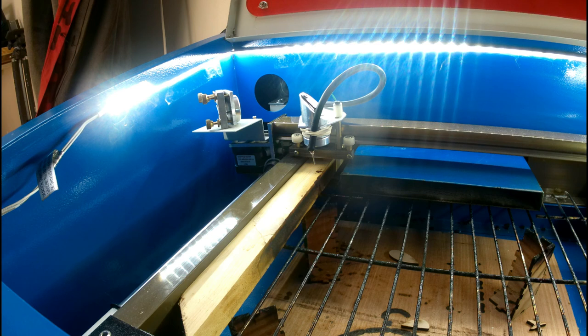These are stock mirrors with an upgraded lens. There's only really one lens you can get without upgrading the head because it's a 12mm diameter — the rest are 18mm to 32mm from what I can tell. I do this every few hours worth of engraving; I'd say every two or three hours worth of engraving and cutting.